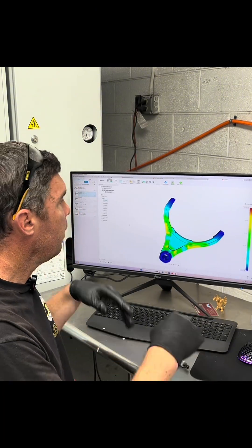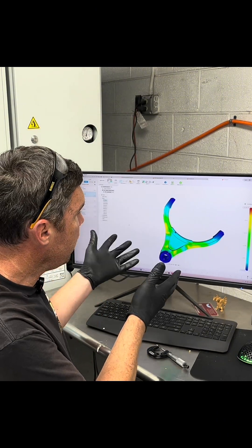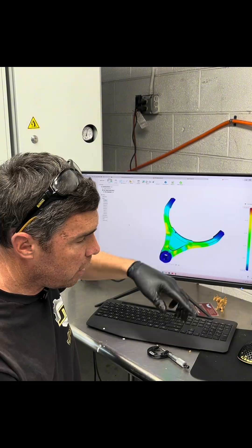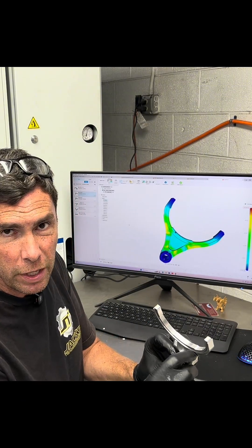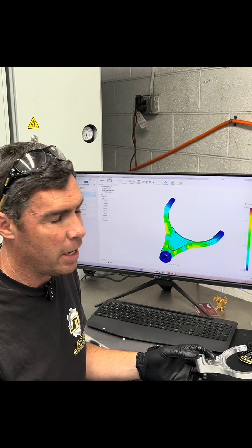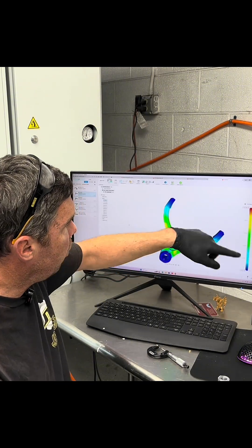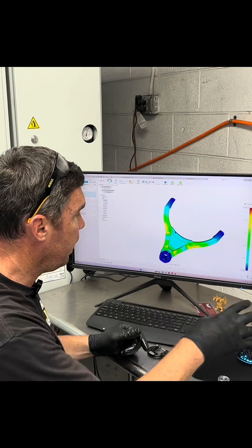In the simulator, we have it at 2,000 newton meters of force and we're checking things like stress risers — what kind of stress are we looking at in the fork? We can see a little red dot here. That's a stress riser. Maybe the next batch that we machine, we'll do a little fillet there. But again, this is worst case scenario, so a red spot really doesn't matter too much. The rest of it looks pretty happy — we're only at the mid-range of what the stresses look like on this fork. It's actually not too bad.